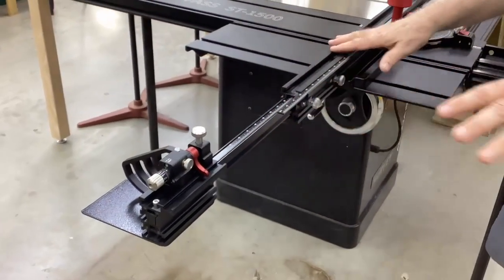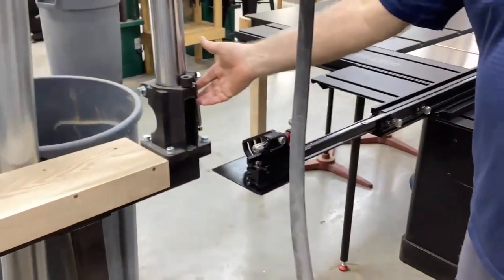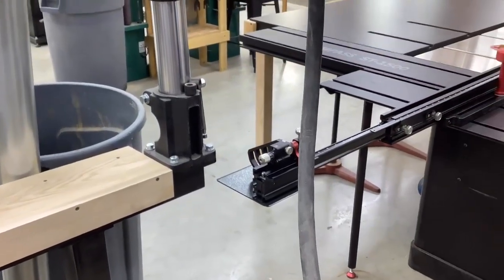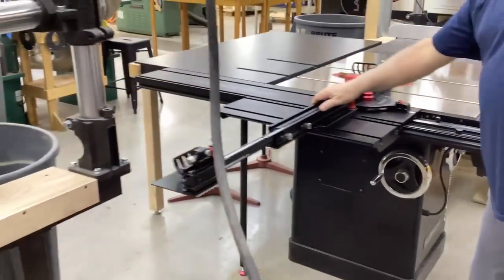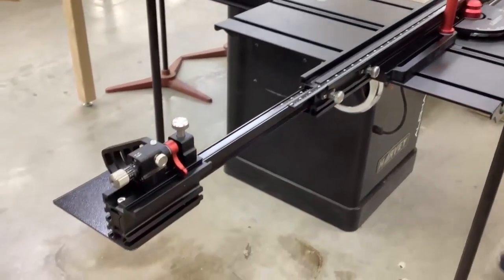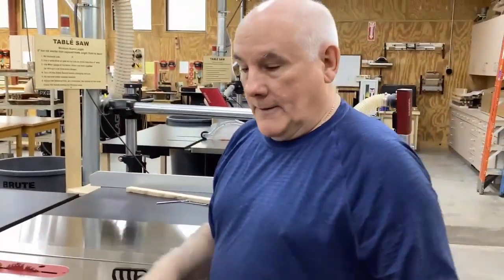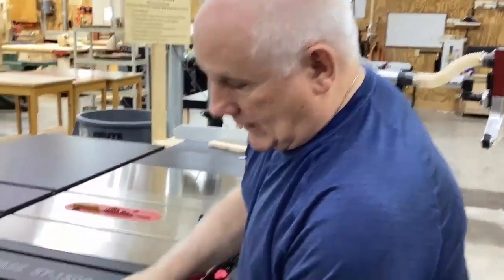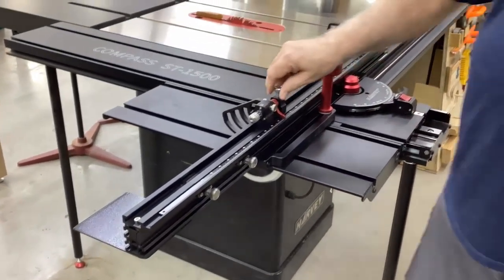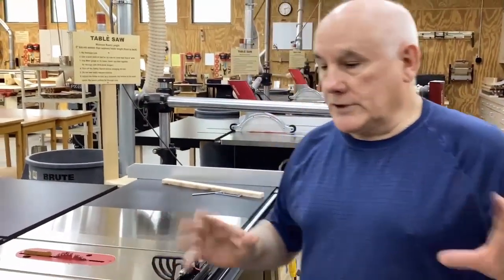All right, the only thing that can be said about this machine, which is a little bit different from the one on the end, is be careful when you go through that you're not going to impact the machine next to it. So please be careful of your clearances on both sides of the machine, front and back. And that goes standard operation for any moving part. So you want to make sure that no part is going to impact the blade, that this part will not impact any other part of the machine around you. And you're going to gently operate this equipment. If it's set up right, which it is, and it's very precise, you shouldn't have any problems in moving a lot of these things around if you do it in a gentle manner.